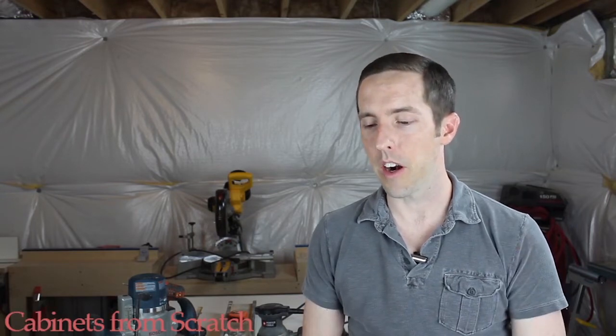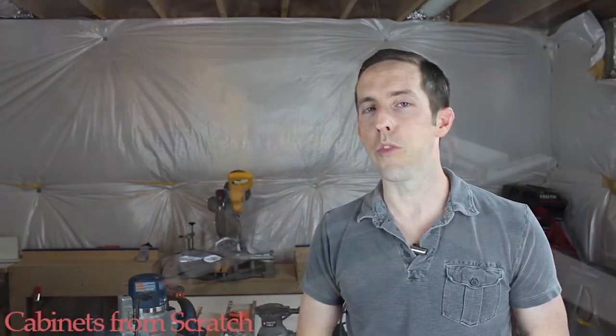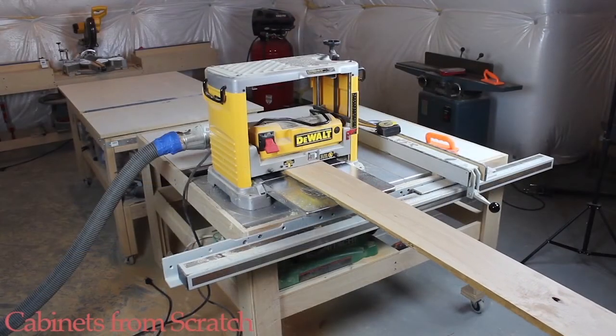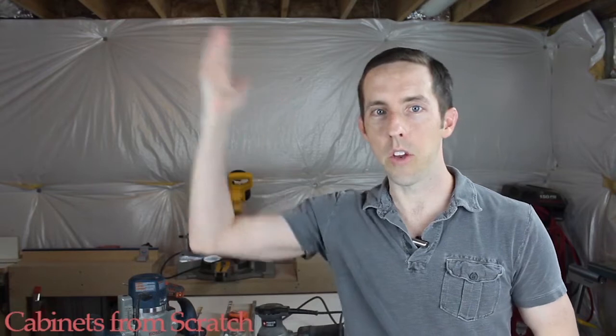The next optional piece of power tooling you may want to consider is a thickness planer. I'll show you what that looks like — I've used it much more often than the jointer. A thickness planer takes that rough lumber after you've passed it through the jointer a couple of times and cleaned one of the surfaces and one of the edges. You can then reduce the thickness by running the board through the planer and get a perfectly three-quarter inch thick board almost like buying it from the store, but better because it's freshly done.